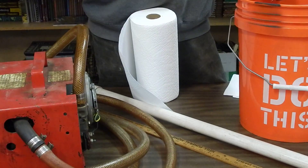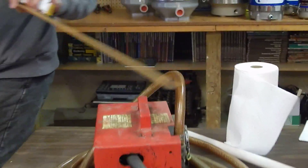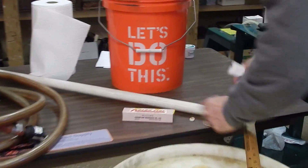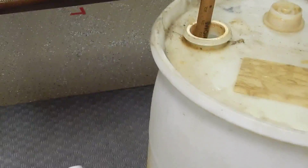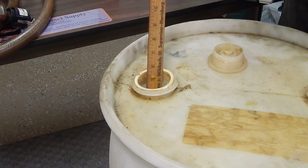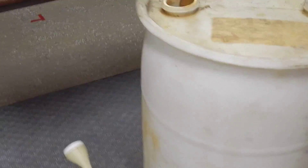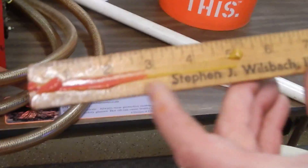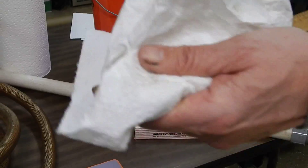Right here is the critical spot that will make your job so much easier if you just do a couple simple things. Water marking paste — when I get up to a job, this is an empty drum. I put my paste on. You can see it's gold. I dip it in all the way to the bottom, I pull it out. I can see what's in there — it'll turn blood red. As I'm pulling it out, I'm running the paper towel down it, so when it comes out it's already clean. There's the bucket — it gets thrown in there. I filled this up with water — it goes from gold to blood red almost. This is the best thing going. Now I know my water's at three inches.